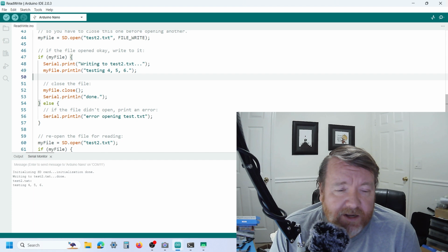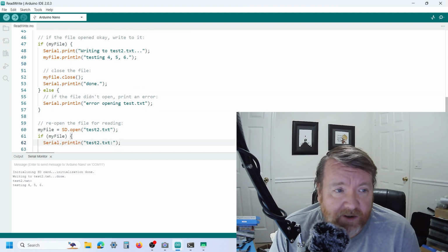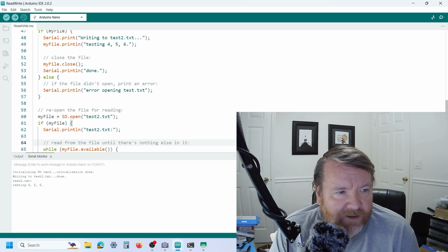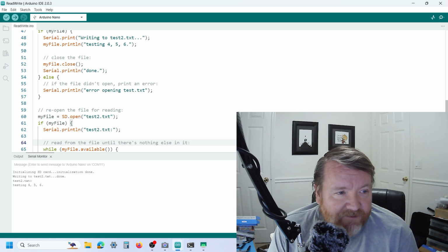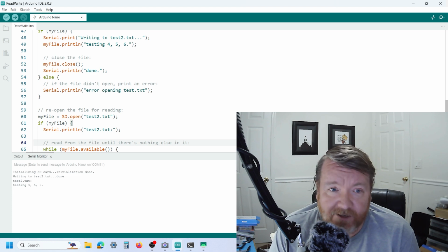So it's an incredibly simple interface, but it gives you very quickly and very cheaply, as I said, I believe the holder for the SD card was, I think, $1, and the level converter was $1. Actually, the most expensive thing probably is the voltage regulator, which I think was $2. So for $4 plus the SD card, you can get 32 gigabytes of storage and hook it up to pretty much anything that you want.